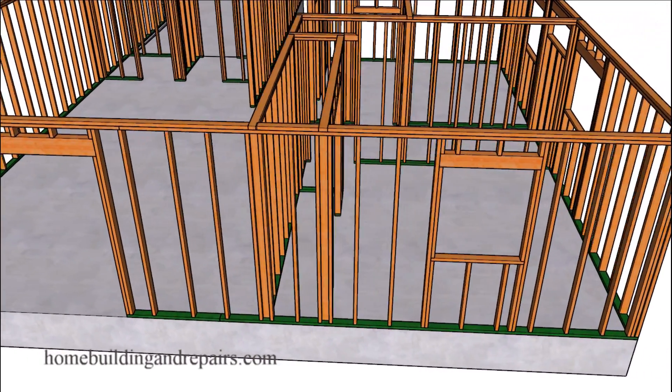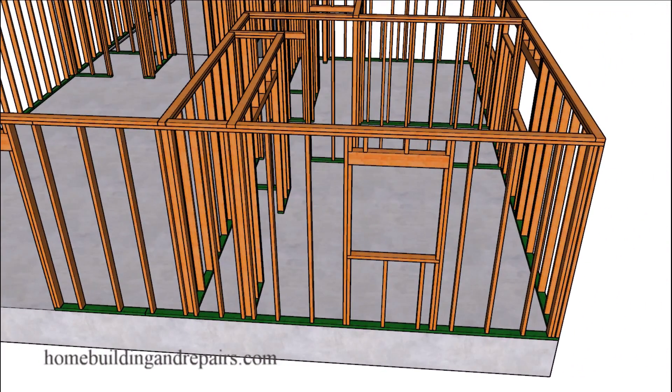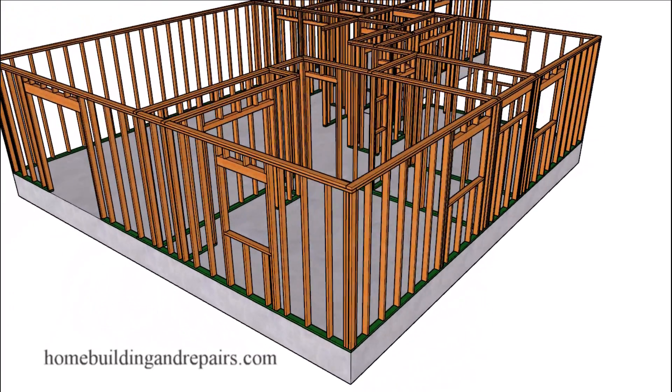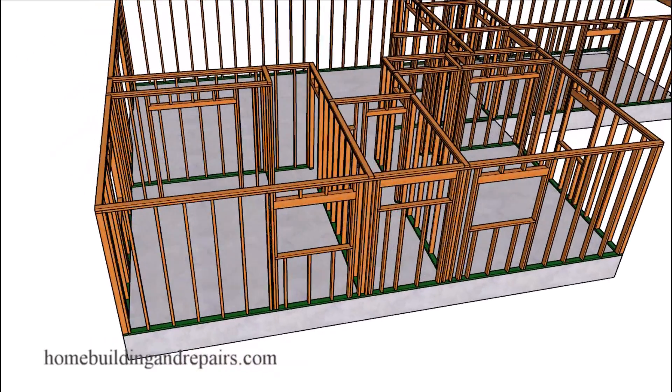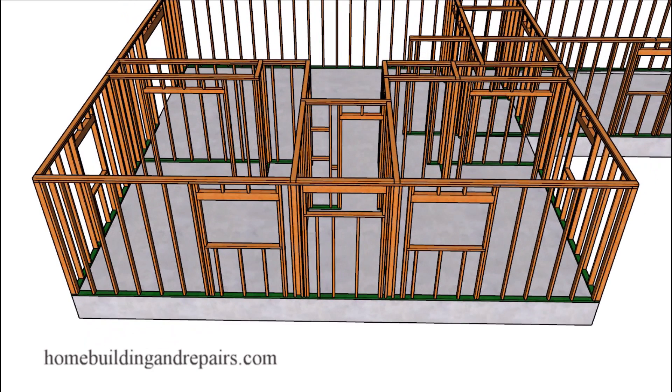Looking at the back room, living room, and bedroom — I did make these windows a little longer. In the original plans I had them at three foot; I went ahead and changed them to 42 inches or three foot six inches. These two wider windows are going to be fire egresses — emergency fire escapes. You're not going to want to go through the house if it's on fire; you're going to want to jump out one of these windows.